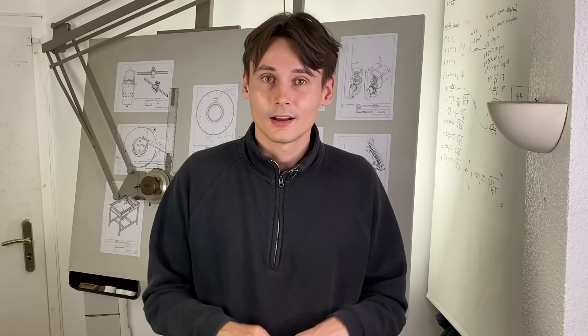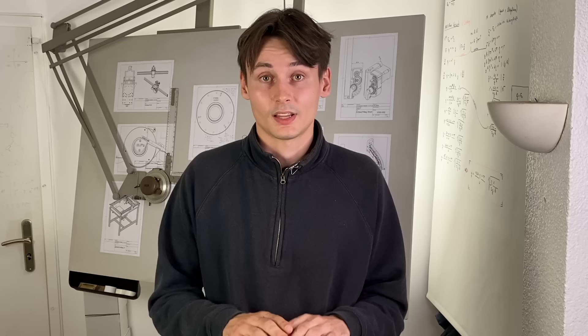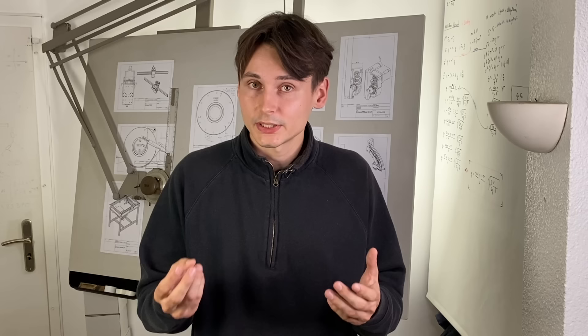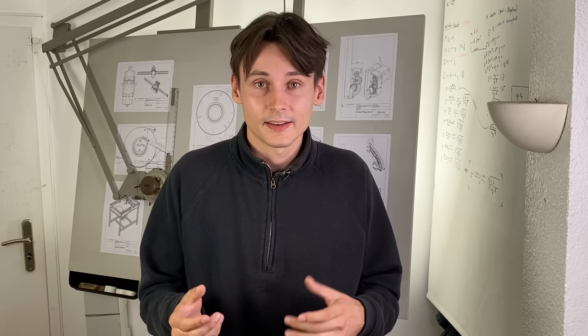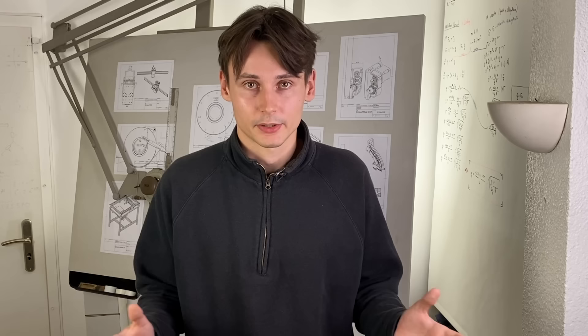The third, and perhaps the most controversial and interesting challenge, is that we are running power and data over the same cable. This practically forces us to use some sort of differential signal transmission. But even with a twisted pair of wires, the fact that we are running a noisy power line next to a signal line is a real concern for signal integrity. A real alternative to this, and something that I was going to integrate anyway, could be sort of an IoT-style Wi-Fi connection. But I have not really decided on that yet.